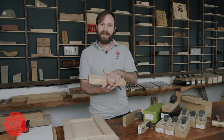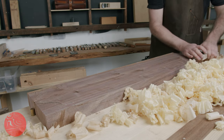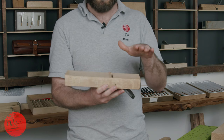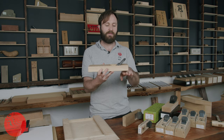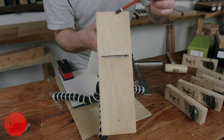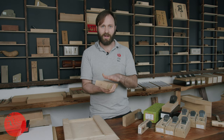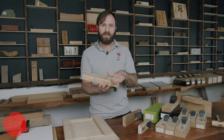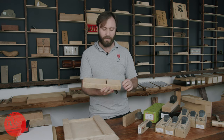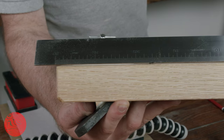What this relief allows you to do is smooth really, really nicely. There are lots of subtleties in this tuning pattern. However, when you start getting contact patches behind the blade, even just one contact patch there can lift the plane enough that the contact patch in front of the mouth will also lift. That introduces a lot of compromises in your planing process. So whatever is happening behind the blade, it's really important to maintain a contact patch in front of it. This plane will be beautiful for smoothing and easy to tune because it has been relieved behind the blade.